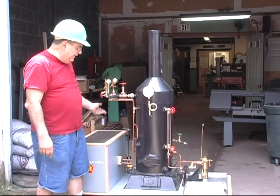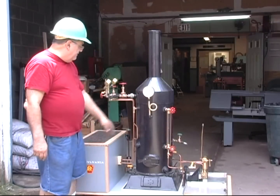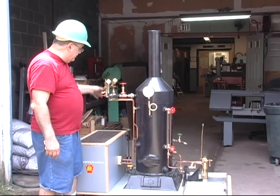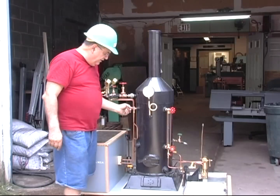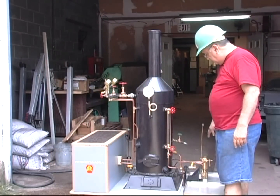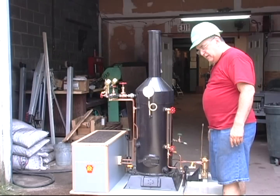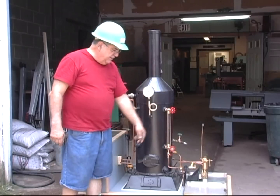I don't have to mess with it, it's already filled. This is the gauge glass, it's half full right now. Main pressure gauge, got a whistle back there. This is the turret with the Mercer safety valve. We have an injector that feeds in here, and down here we have a pump — basically a Van Brocklin design pump. It's just a temporary pump to pump water in, and later on I'm going to put in a duplex horizontal duplex pump.